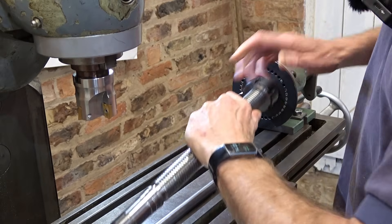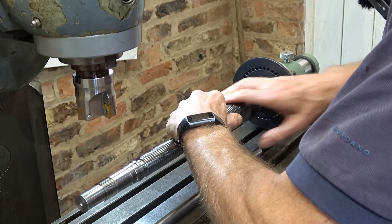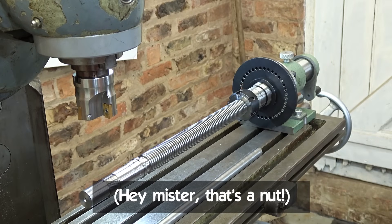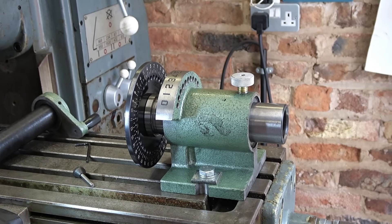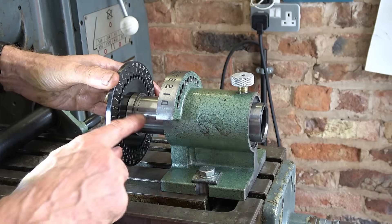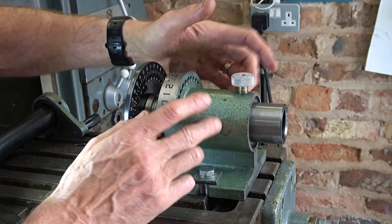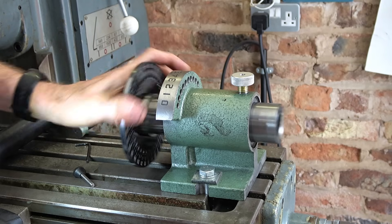20 millimeter collet now. I've got the collet screw with the bearing in it so you can get it much tighter. There's always some little problem lurking to catch us out — for reasons I cannot explain the body on this spindexer has gone tight. It wasn't like that before. I thought I might have clamped it down unevenly and twisted the casting, but it's not that — so why has it suddenly gone tight?